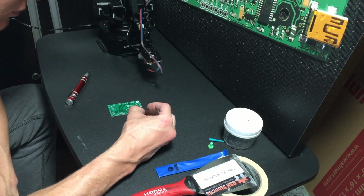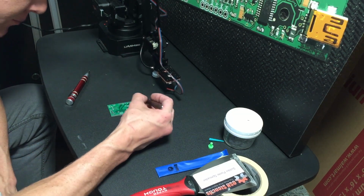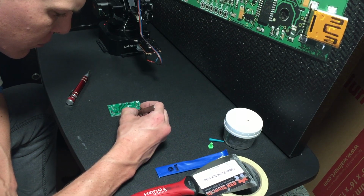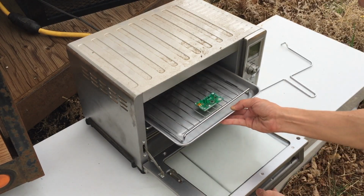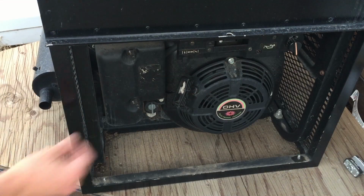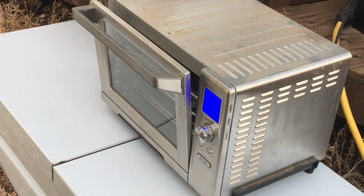Our robotic teammate, UBART, is learning to handle panelized pick-and-place, but for our first board, we simply hand-place the components with tweezers. Once every component has been mounted on the board, it is taken outside to our extremely high-tech reflow oven. Well, actually it's a very low-cost convection oven. Using a major overkill of a power source, this baby circulates enough heat to broil to turn all paste into solder in 3 to 5 minutes, without ever getting close to hot enough to damage any of our components. This makes it a perfect setup for our open source startup.